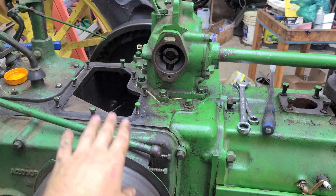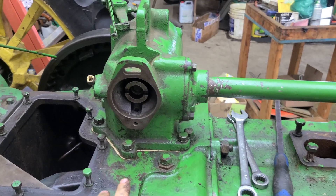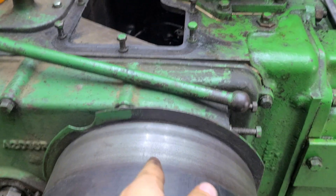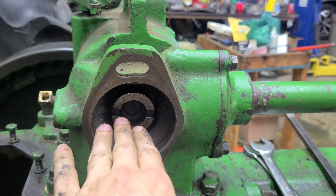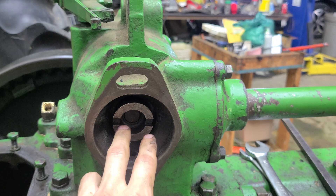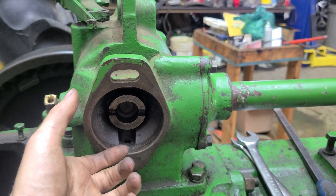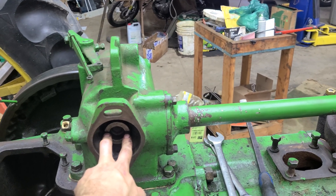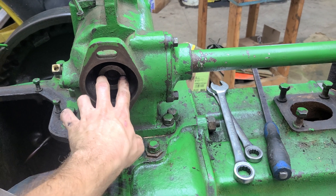Working our way forward: camshaft, crankshaft, flywheel, clutch driver — and the last important thing is the governor. The governor has a gear that interfaces with the camshaft gear. With everything in position at top dead center, left-hand impulse marked, and clutch driver set correctly, this slot on the governor should be perfectly horizontal. When you set down the governor and mesh it with the camshaft gear, it should be close to horizontal. If it's one tooth off, you'll have to adjust your magneto to its maximum, and if it's too far off the tractor won't fire correctly, because this controls when your magneto fires.